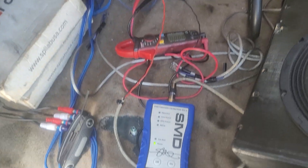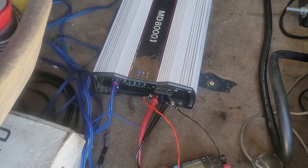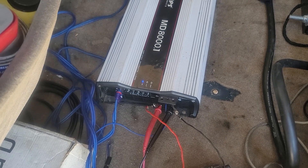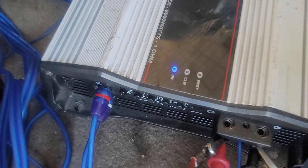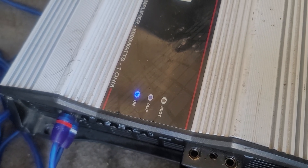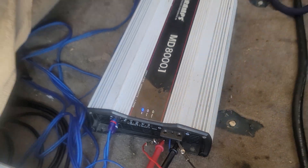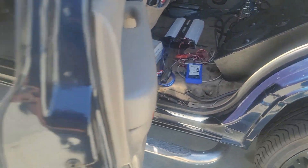So I'm going to go by, just like every other amplifier I tested, the distortion detector — the DD-1. Even though the clip light may clip a little bit afterwards, once I go up on the gain on the amplifier, instead of blinking clip, which most amplifiers do so you can back off, this amplifier went straight to a solid clip and then protect. I'll show you guys what I mean before we go ahead and do it with the DD-1.